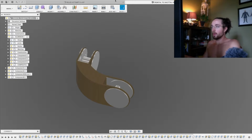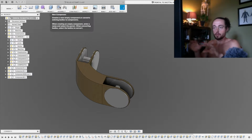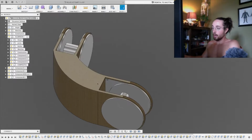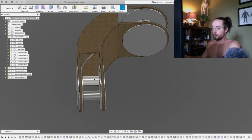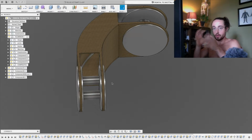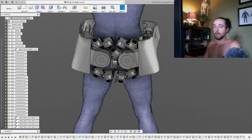So there's aluminum running through there, so I have parts to build off of, and then I'm going to 3D print into the gap. I'm going to 3D print parts and glue it all together, and then wrap it in this, like that. And then there's also a metal part that slides in the middle of here, and that gives just a very solid mechanical spot for that to fit onto to start with. And then composite reinforcement on the back.